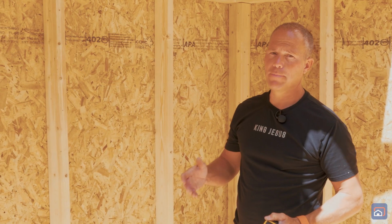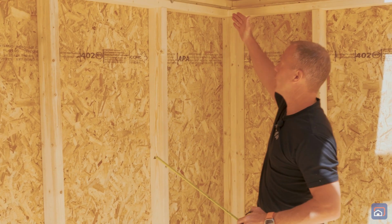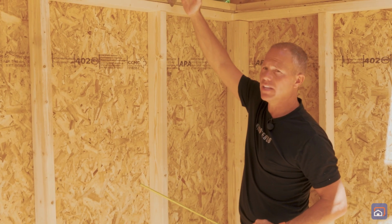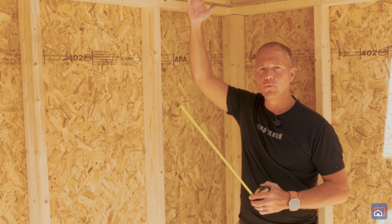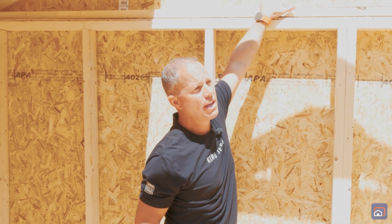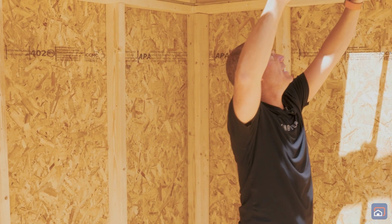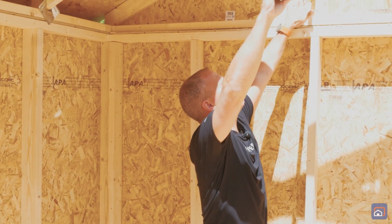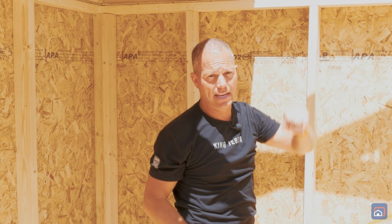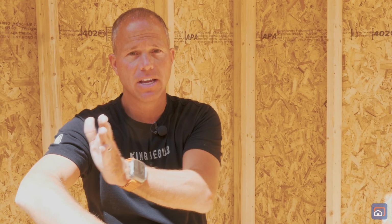Start our roof sheeting. A couple things that we have to make sure, and it's imperative that we pay attention to these measurements. If you remember, when we set our first truss, it was 21 3/8 inches to this edge. As we're setting our roof sheeting, the first thing that we did was we wanted to make sure that we plumbed the outside gable. Once we plumbed it, we tacked the outside edge of the roof sheeting. Once we did that, we then measured from the edge of the gable over to our truss, making sure it was 21 3/8 of an inch, and then we tacked it. Once we tacked it, we hooked it, and if you remember, we then went 24 inches the whole way across.